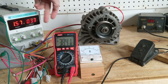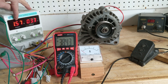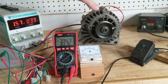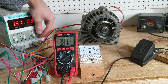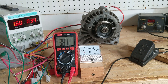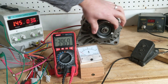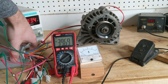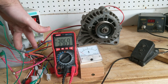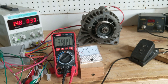To the armature — the part that spins — I have 3.3 volts at 1.57 amps energizing it. I can change this and increase the amps if needed. So I have about 3 volts and about 1.5 amps energizing the armature. The stator windings are going to the speed controller, which is connected to a 36-volt lithium battery.